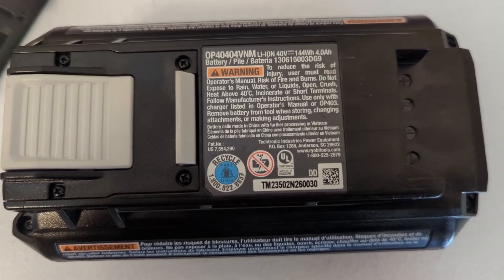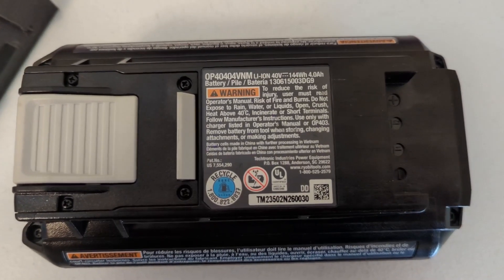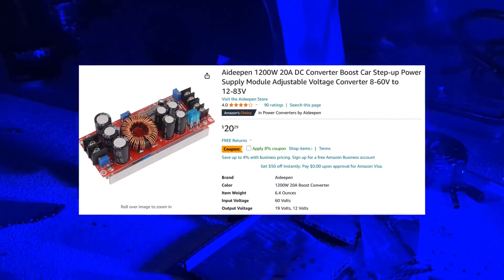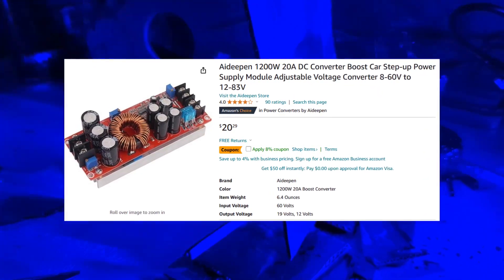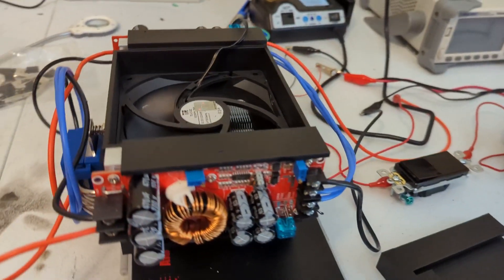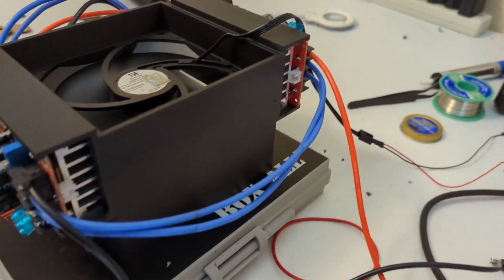The battery stores about 144 watt-hours worth of energy. If the laser diode array is drawing about 320 watts of electrical power, then this battery should last a total of about 20 minutes. The last problem in adequately powering the device is supplying 96 volts and not just 40. The microelectronics revolution has pretty much standardized every boost converter to have a load-sensing feedback controller, which can adjust its parameters to meet the voltage requirements of the load. After looking around for high-power boost converters, a couple landed on my radar and they were quite cheap. When they arrived, it was just a matter of wiring everything up. While this chassis is a prototype and far from the final design, I'm still working in Blender to make a consolidated portable design — so subscribe and stick around for later videos.